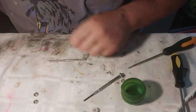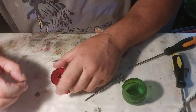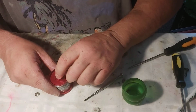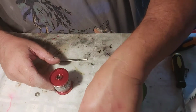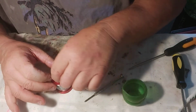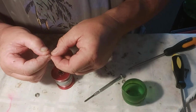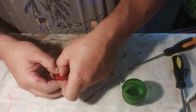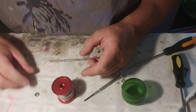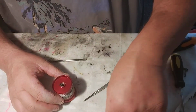Okay, and the assemble, we go back onto there, inside these. Okay, we do the other end first. So drop that bearing in, put him over, push that in. This little bracket goes that way up, so rough side up, just so that it tightens in. Tiny little circlip. It's always worth having half a dozen of them, because I tend to lose them. They ping everywhere.